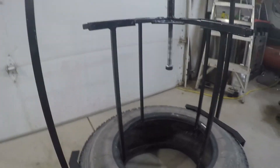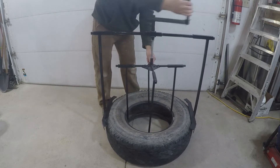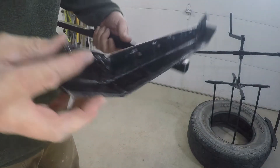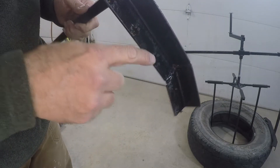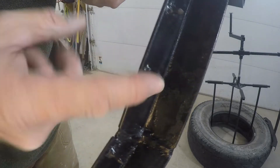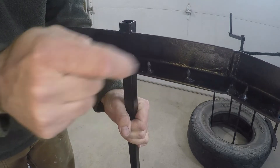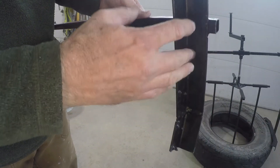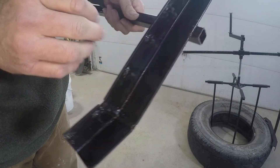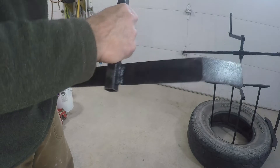Here's the last change I made to JD's design. I cut little pieces of 1/8 rod, ground little points on them on the bandsaw, made a bunch of them, stood them on top, and hit them with a MIG welder on a real light setting. They all stayed in place and I burned them in — these really bite the tires well and it doesn't want to slip off at all. A little extra work but I'm really happy with that part.